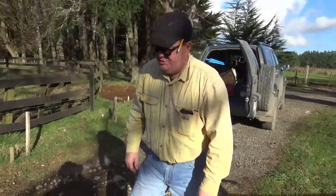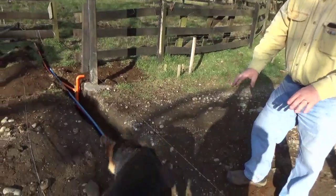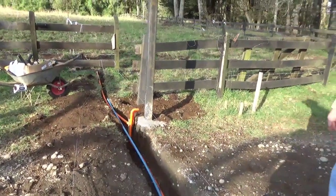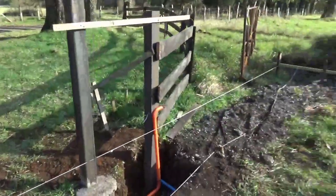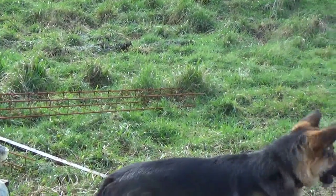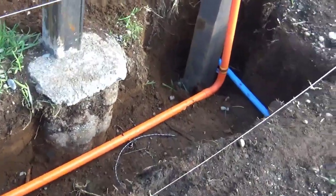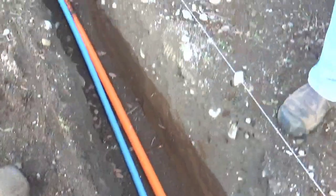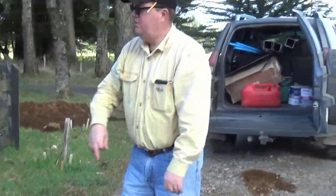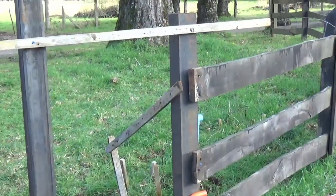Thomas and I worked all day yesterday and cleaned up our ditch. We've got our rebar pillar — in Chile they call it a 'pilar' — that goes in here; it's a rectangular pillar, 12 inches by 6. We've got our water line in, and our water and electric down in the hole. What we have left to do is set two fence posts and connect the water up. Since I'm putting a spigot at this end anyway, I'll connect that up and make sure it's working, and we'll use it to mix our cement.